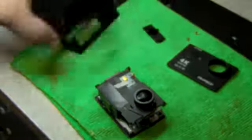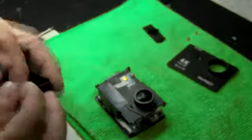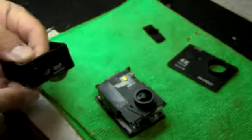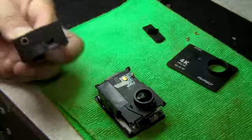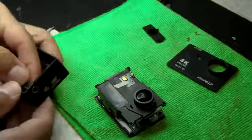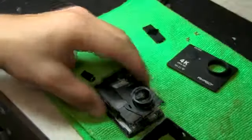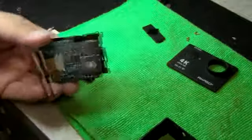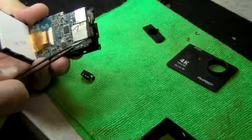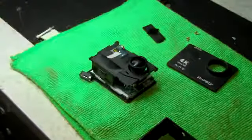On the actual camera mount itself, on the shell, this is what it's going to look like. I already made the hole, and from the outside, that's what it's going to look like. Okay, so if we look closer here, like that, that's what it should look like. It should look like a regular connector. So in order to put this in, we have to add some hot glue, and we also need to wire in the cables, the wires, and they're going to be little thin wires, so be careful with this. And the connector where you're going to actually connect these wires will be here, and I'm going to show you here at the top, right in that location. The reason why is because that's where the microphone electret is, right there. See? So on the next phase, we'll go ahead and continue on.